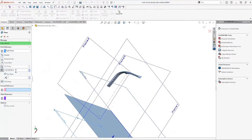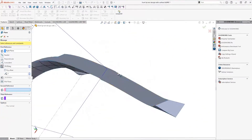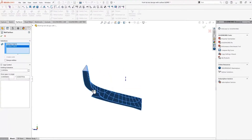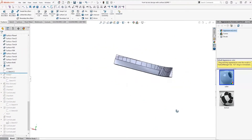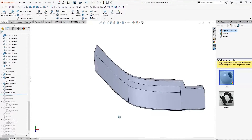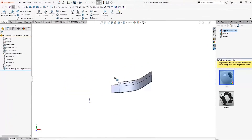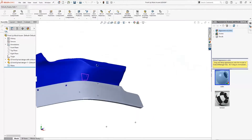Skipping ahead a bit — essentially what I'm doing is I've trimmed those back enough that I can come in and fill in a couple of surfaces and then knit them together. Once those are knit together, I can start to really build out the rest of my solid model. I'll come in and start building the rest of my extrusions, extrude that out on that angle, build out the rest of my lip, add some chamfers and detail it, add in some countersinks for the various bolt holes I need. I'll mirror that over to get a proper left and right side, and then bring that into an assembly to see how the part is ultimately going to fit.